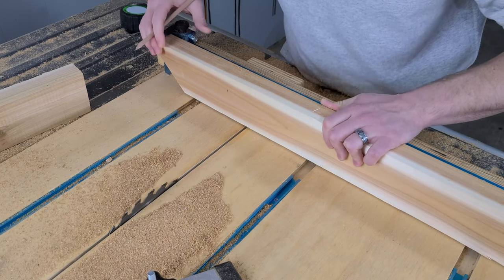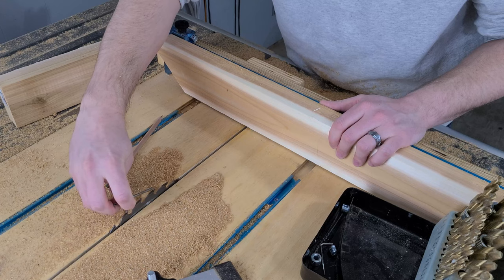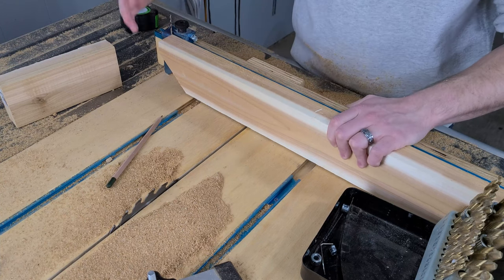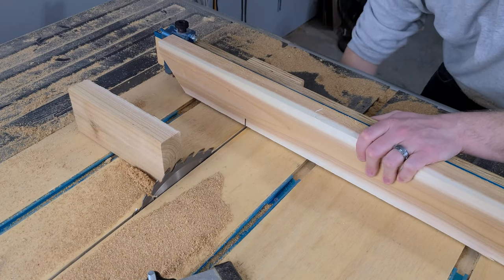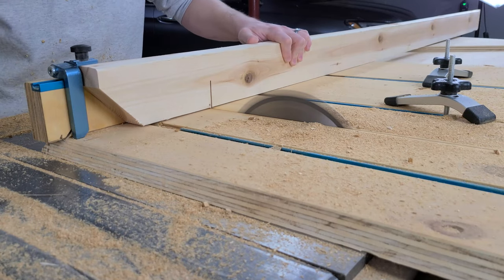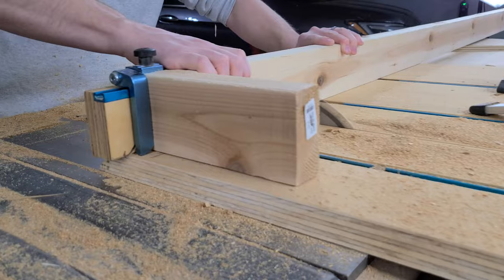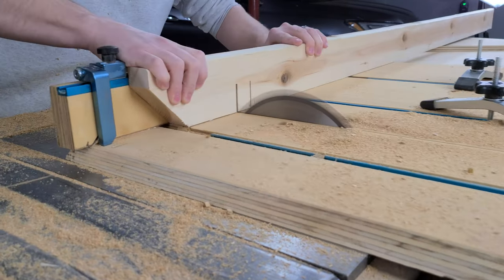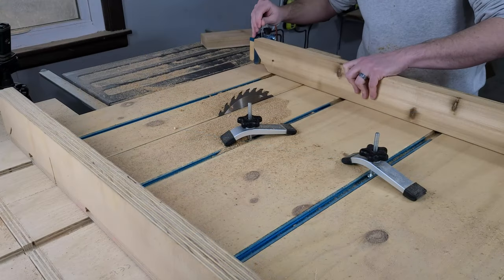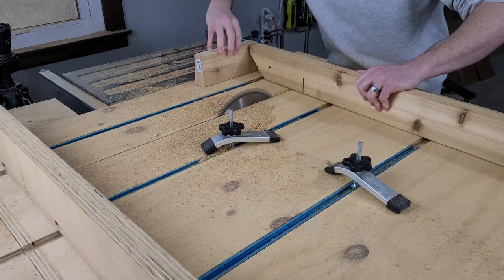Time to make some assembly features. Let's start with a half lap joint. It's a versatile joint that can be made with various tools, but we prefer using a table saw for its speed, precision, and repeatability. First, we position the blade where we want the notch to be, then bring over the stop block to set the position. Instead of putting the stop block against the piece, we create a blade-width gap between the edge of the piece and the stop block using an eighth-inch drill bit. We raise the blade to half a board thickness and make the first cut, then slide the board to the left and place an off-cut piece between the board and the stop block to set the perfect end point for the joint. All that's left is to remove the material between the two cuts by advancing the board back to the right and making multiple passes. There you have it — an easy, perfect half lap joint.